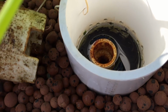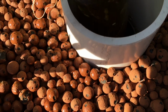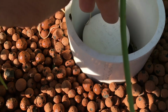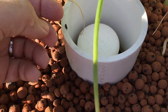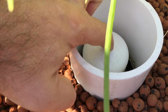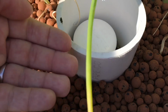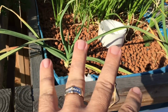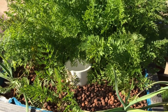And as the water starts spilling over that, and you have a bell over it like this, it actually creates suction right here. As it overflows into that pipe, it starts to create a siphon here, and it can only pull from the bottom, so it pulls all the water down. This basically works off gravity as well, so there are no moving parts, which is going to kind of blow your mind when it first does it, because it flushes automatically.